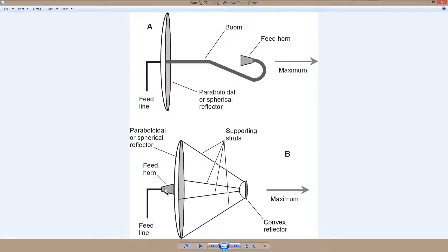When you transmit, the signal goes out through the feed horn, which is aimed right at this convex reflecting element. This convex reflecting element is kind of like a half sphere, and it bounces the energy back to the dish. This is placed at the focal point of the paraboloidal or spherical reflector, and then the waves come out parallel, just as they would from the conventional design. When signals come in parallel, they come back and hit this little spherical element at the focal point, which directs them in a beam right into the feed horn and then through your feed line down to your receiver.